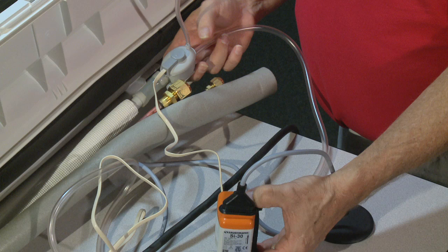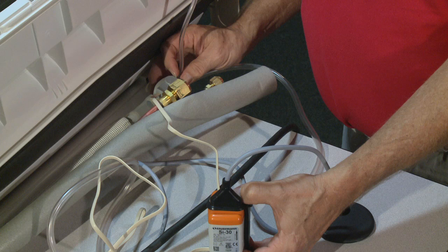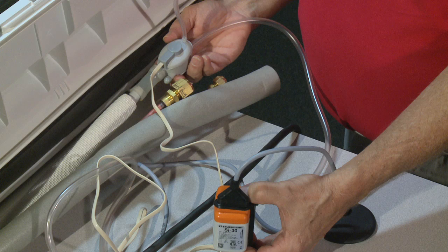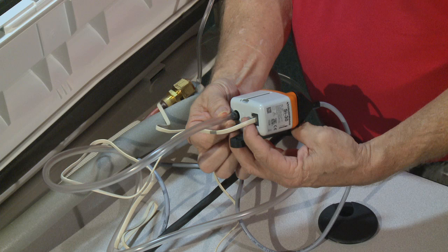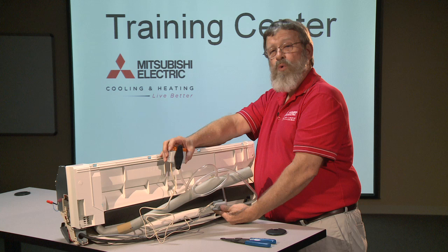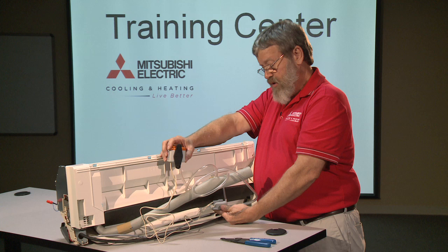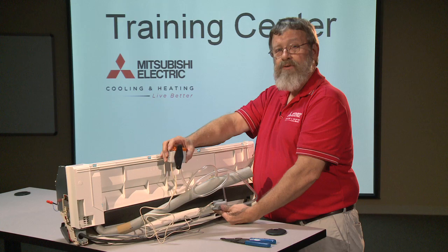This float switch has a vent on it. When the pump shuts off, a little bit of water will come back and needs to vent slightly, but it's not going to come out. You must have it mounted and installed straight up. After that, check all the connections: hose connections, both ends of the check valve, the discharge of the check valve, suction side of the pump, and discharge side of the pump to wherever you're grabbing a drain. Once the pump drains out, do it twice to make sure you get good condensation flowing. Then recheck all your hoses and make sure there are no condensate drips anywhere on the system.